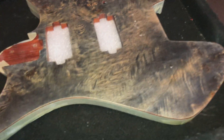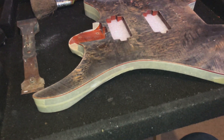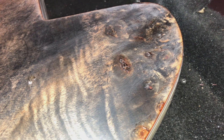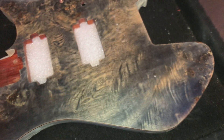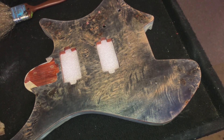The poplar burl just had a bunch of holes in it, so I wanted to take some CA glue and fill in the holes just so there's no problems with the veneer sinking into anything. That's basically what I did today, and that was part two, guys — so stay tuned for part three, which is going to be actually applying the veneer. I appreciate you guys watching. Don't forget to like, subscribe, and share if it suits you. Thank you, guys.